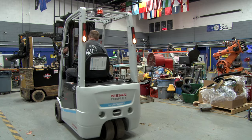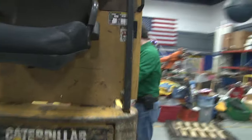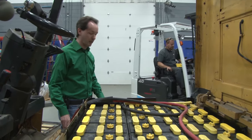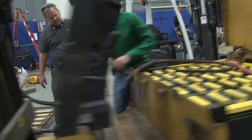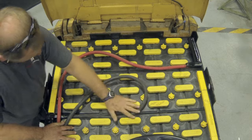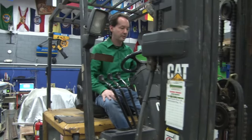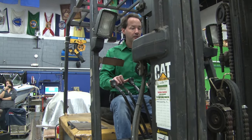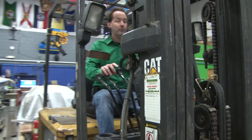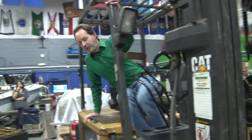This battery is already charged and conditioned — had a hot oil treatment, maybe a little rub down. So I can just plug this right in now. We'll make sure everything's the way it wants to be. The plug fits perfectly — we don't need the old cribbing lumber anymore. Make sure all of the cabling is laying down nice so nothing touches when you drop the cover, because it's a lot of electricity. And the forklift says we have a full charge — oh my god! We have eight bars, which is awesome — and it's snappy. This is way better.